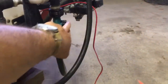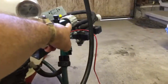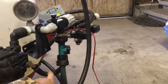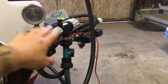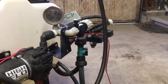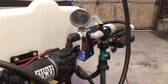What I do is I open both these valves all the way, turn on the motor, and I set this for 40 PSI. Then I start closing one and I'll see my pressure gauge go up, and I adjust this accordingly. The proof in the pudding is when you squeeze the trigger on your wand. I'm going to turn this on in a moment — it's going to get a little loud.